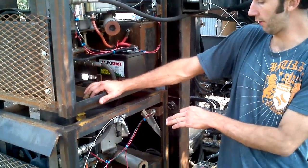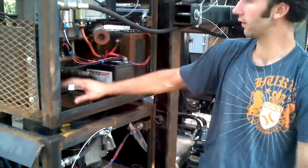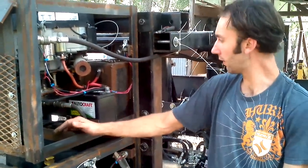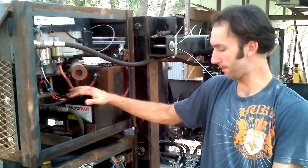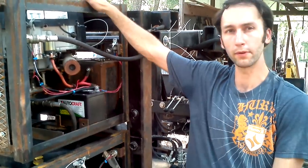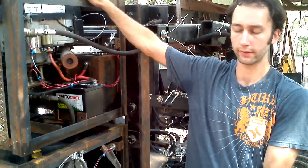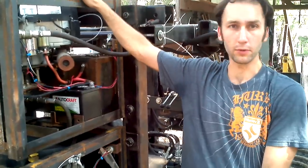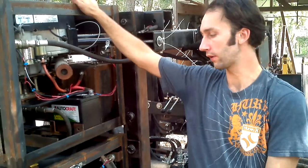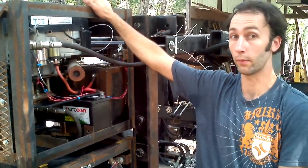We have a little bit bigger fan on the bottom — it's from a Ford — and a little bit smaller one on the top. As it is, we're maintaining above 12 volts on the top, about 12.5 fully revved up to full operating RPM. The bottom one is about 12.3. That number fluctuates when you go from idle to full speed. It's probably just adequate to keep this unit going as is, but any add-on is going to require more power.